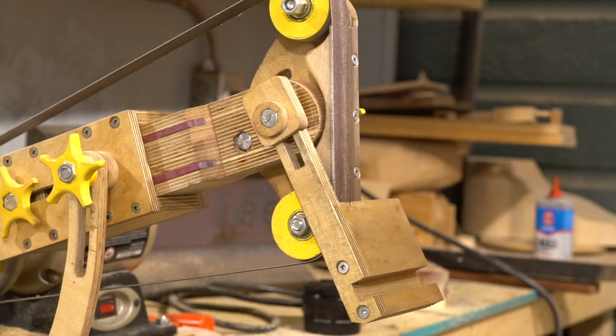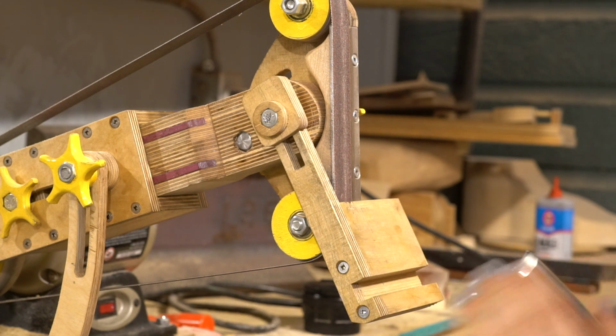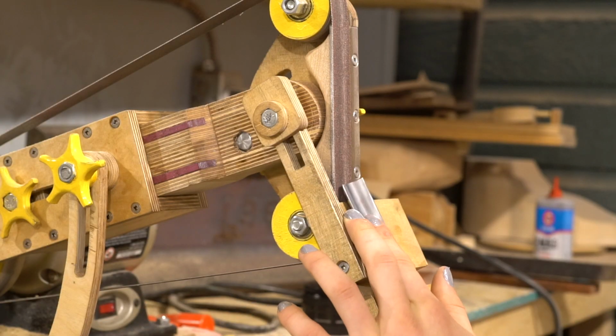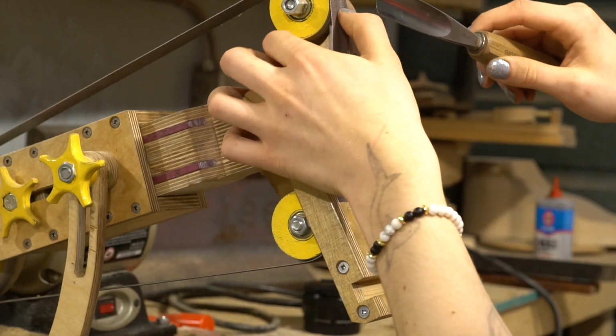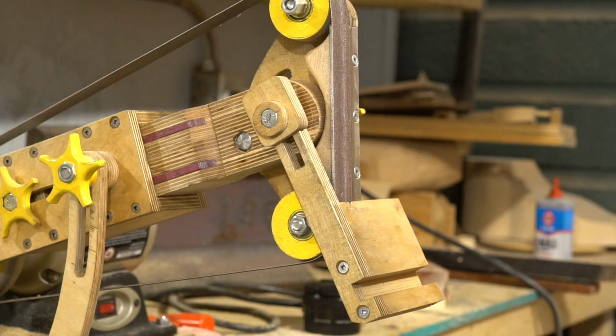The way I sharpen my gouges usually is to create the primary bevel and really the main shaping. I'm going to use a belt grinder like this. So either I go here and I turn it this way, that way I can keep a very steady angle, or I actually go on the dip here between the metal plate and the wheel, so it's a little bit flexible, and that way I can easily keep a very constant radius. So it works quite well with both ways.